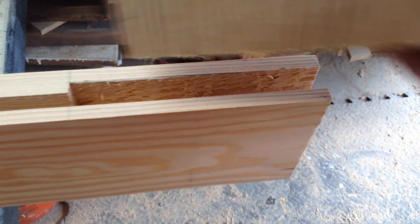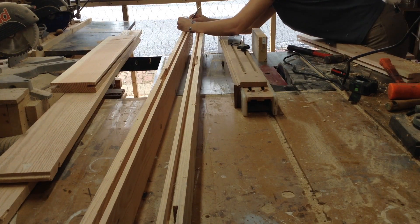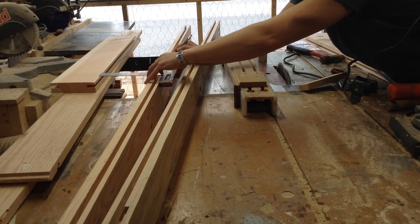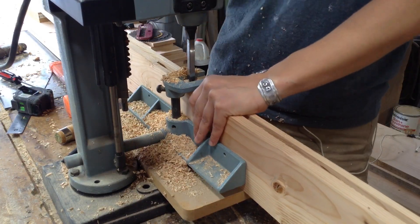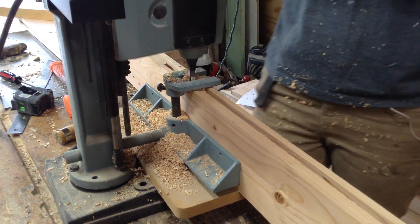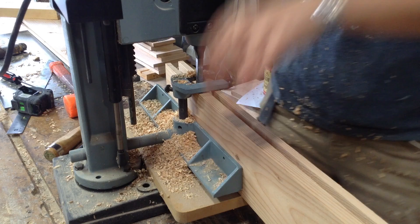The little bit of spacer on either end won't be cut — just those two bigger portions in the center form the double tenon with haunches on the edges. This is Douglas fir, so the mortising machine leaves it a little sloppy and there was some cleanup to be done. I'm using a jig to transfer the layout to the rest of my pieces and then cut them on the mortising machine. Using the mortising machine is kind of like a drill press — it's pretty self-explanatory. It's a matter of staying in those marks and cutting down through the pieces.